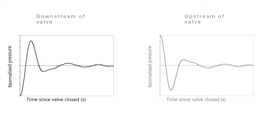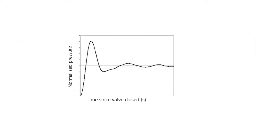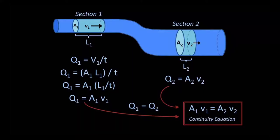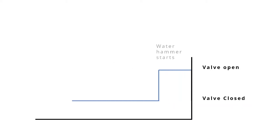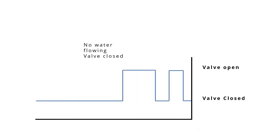As you can see here, the closing of the valve sends a pressure spike down the pipe. Opening it back up creates another spike. These pressure spikes are equal and opposite, due to the continuity of energy equations. You can think of this like the water hammer – which is the second spike – as being like noise cancelling headphones for the system, cancelling out the initial spike and thereby mitigating the detrimental effects on the pipe's infrastructure.